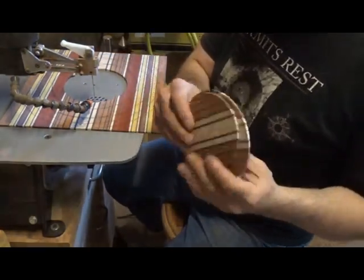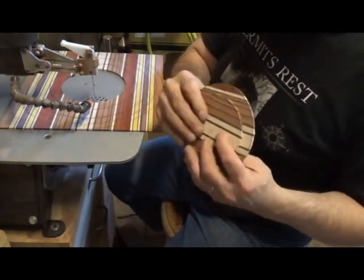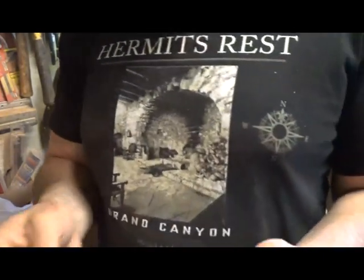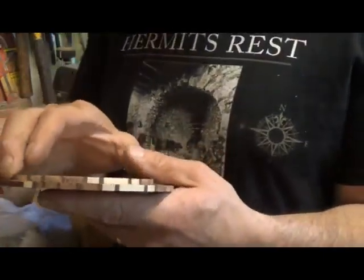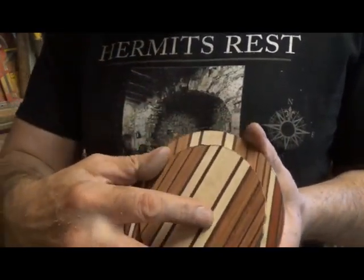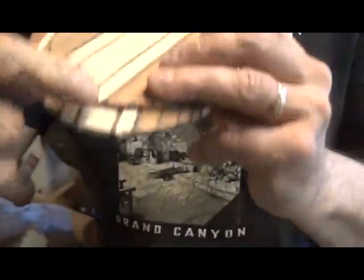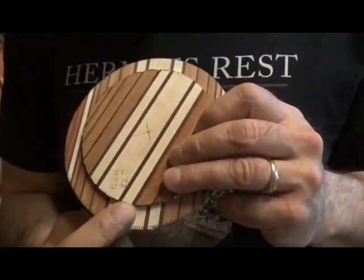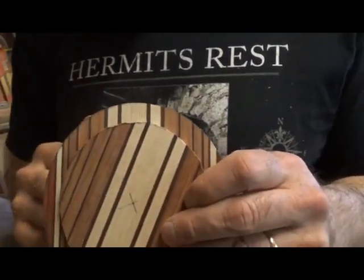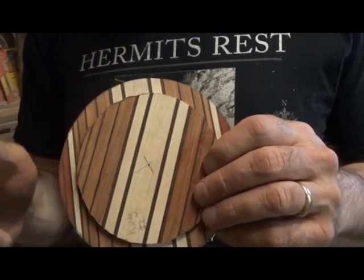What I'm going to do is glue them as a whole here. Then once I do the lathing, I'll just dig into it and clear out what I want to get rid of. I haven't totally figured out how much of a twist I'm going to have. So there's with no twist on it — now I'm going to twist it. By how much? What I like to do is pick a spot. See, this is lined up with this one here, and then I do the same here — this will be lined up with that. So you just pick a spot on your boards and always twist it that much. You get a uniform twist on it.